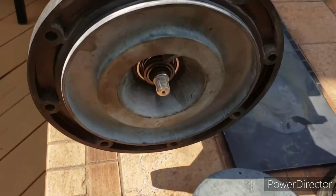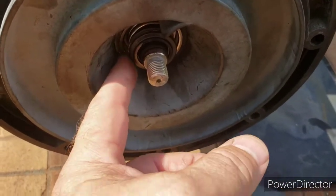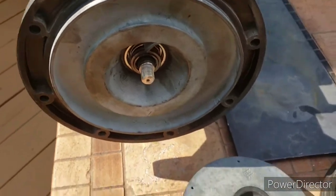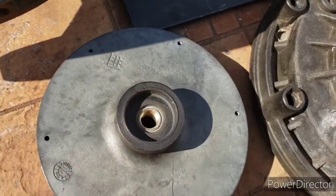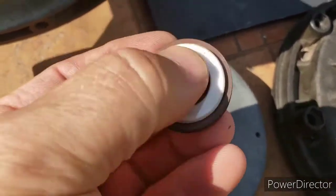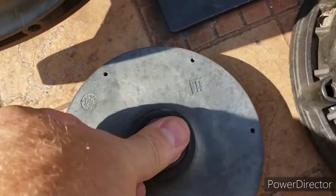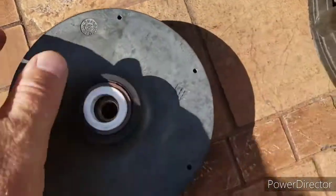On this side I put in a new piece with the metal ring, the spring, and the washer to rejuvenate the pump. And then there's this piece over here — I had to pop out the old insert, which is rubber with a porcelain piece. So we're going to push that in so it's down there nice and tight, and there's a little bit of a gap there.